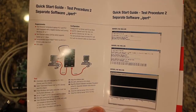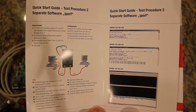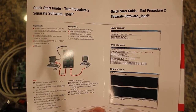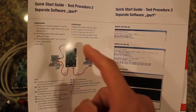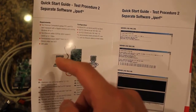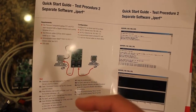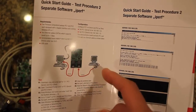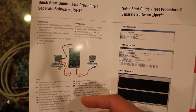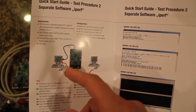The second method is to simulate the communication speed between a server and a client. This would simulate a real-life application, with the server being the PC or mobile device and the client being an appliance. Connect the USB cable along with the Ethernet cable from the demo board to the client PC — this simulates an appliance in real life. Then connect a server PC to the other Ethernet port on the demo board, which simulates a mobile device or PC host used to control the appliance in real life.